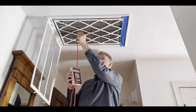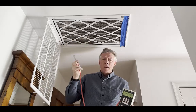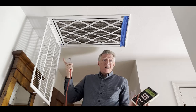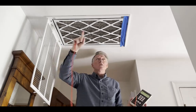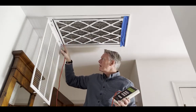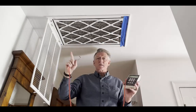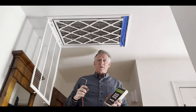The thing about doing it this way is I don't use this method — poking a hole in the filter fabric — with a new filter, because I don't want to leave a hole in the filter. That's bypass, and I don't like bypass. You can see I've got some tape here because last time I changed the filter I put in some weather stripping. So we've got weather stripping on three sides and tape on the other. I'm going to fix the weather stripping this time so I'll have it on all sides and make it easier to change the filter.